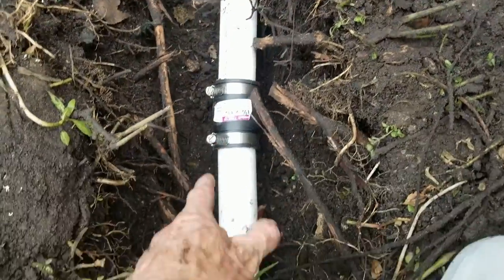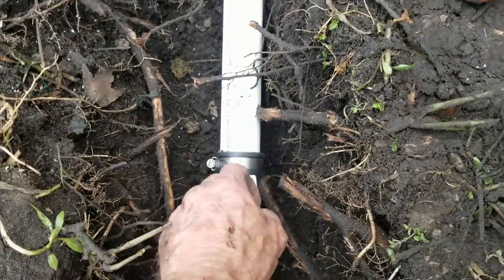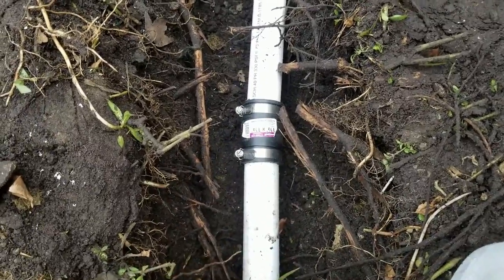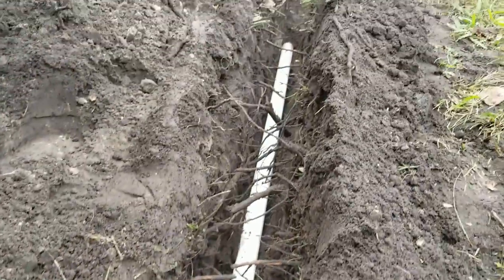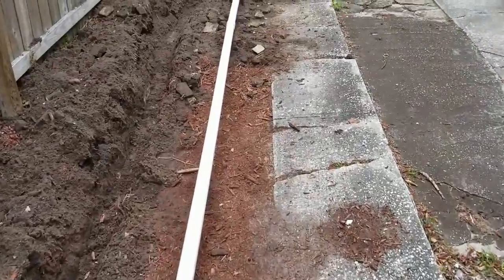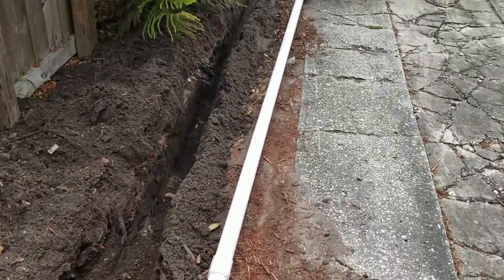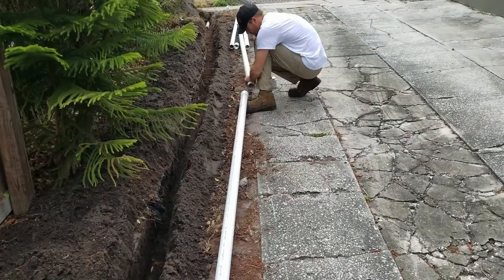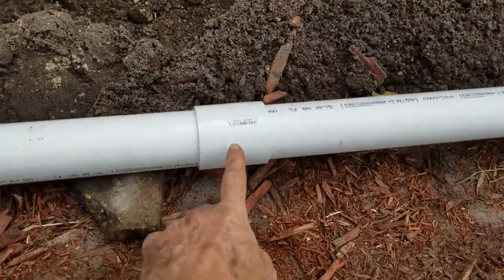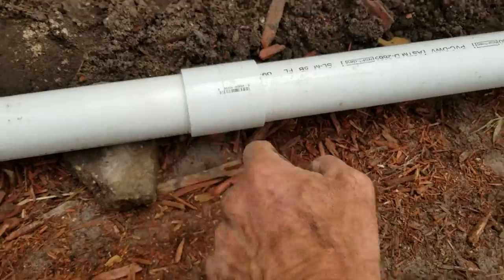From the sump basin we've come out just a couple of inches. I like to use a no-hub here to take the tension off the pump - it's a flexible no-hub coupling, just like on the check valve, hard rubber. It works great, no water is going to leak. Tighten up those clamps as tight as you can. Now we continue with inch-and-a-half and switch over to two-inch right here, going two-inch all the way. We actually glue the pipe together before we lay it into the trench - it's a lot easier. We glue the coupling, push it together and twist it. We're also using deep couplings; notice how deep the coupling is compared to a small one. A few pennies more but really good.